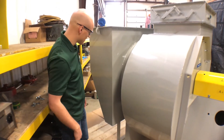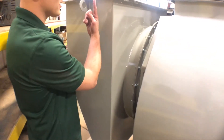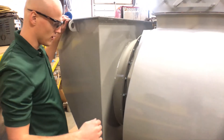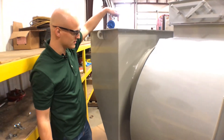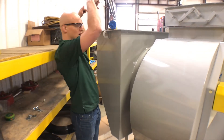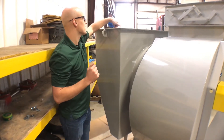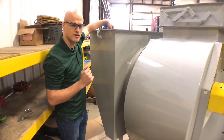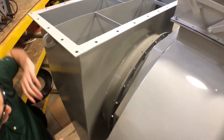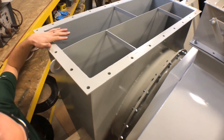We put an inlet box right here that connects to the inlet of the fan and turns it immediately upward so that you have a downward travel of your air into the fan. You can rotate this wherever you want — if your air is coming in from the side or from an angle. This one has a diverter in the middle that actually takes your air down and splits it so that half comes in on the top half of your inlet and half comes in on the bottom.